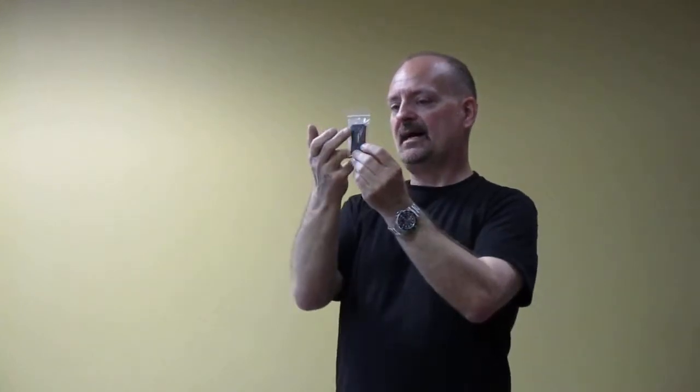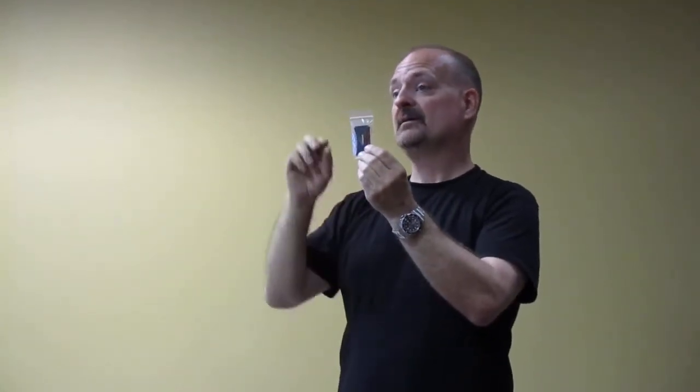Once the whole thing was anodized, I masked off what I wanted to remain red with Super 33 or Super 88 electrical tape. It's awesome because, mainly the 88, if you got a little Harbor Freight bead blaster, sandblaster, or an industrial one, I personally use 80 grit glass and I run it at 40 to 60 psi. 40 PSI is great because I can control it so I don't go too far and screw something up. But the great thing about the electrical tape is it's not affected by the glass media. If you need to get a close edge, it's not going to tear up the electrical tape. So you can get really close to the electrical tape, even go over it, and it's still there.